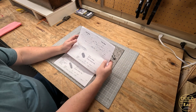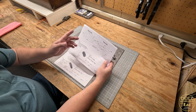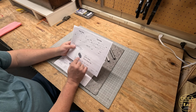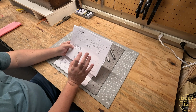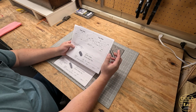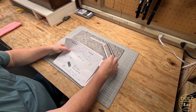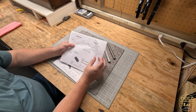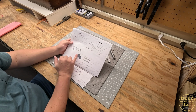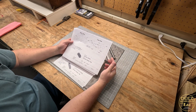And so the first thing I did, these were the original clamps that I just made not long ago in another video. However, these were with 1/2 inch square mild steel that I drew up instead of the 1/4 inch that I made the original ones out of. While I was drawing this up, I decided to use this square stock and switch it up. The original were 1.5 inch long, 1/2 inch square, a little bit more substantial screw clamps.